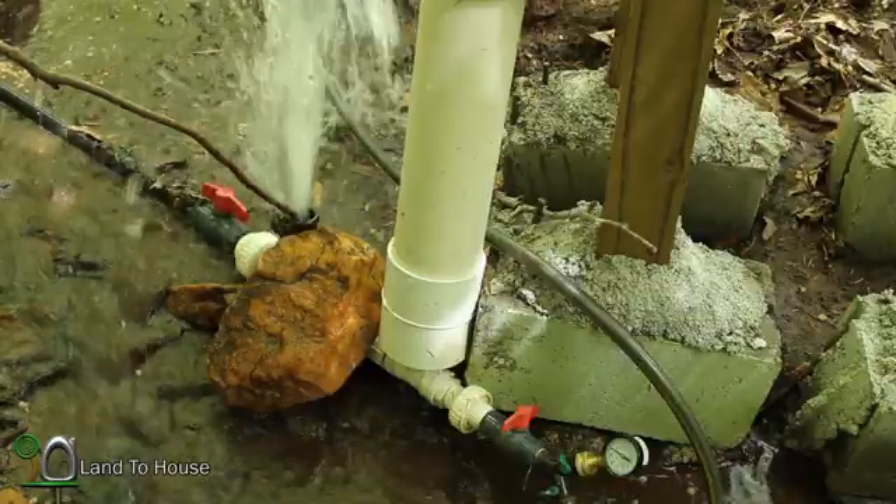I'm going to start opening this. So far it's saying 20 psi, and pretty consistent there. The garden hose delivery pipe is filling up with water here. I hope to start seeing the gauge sneak back up as the hose fills. By now the garden hose delivery pipe is full and water is pumping out at the top.